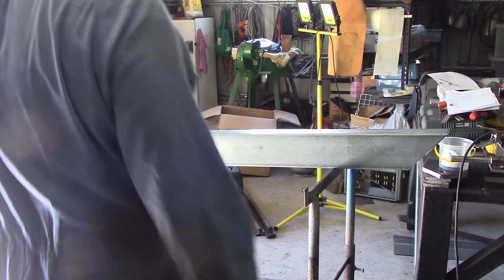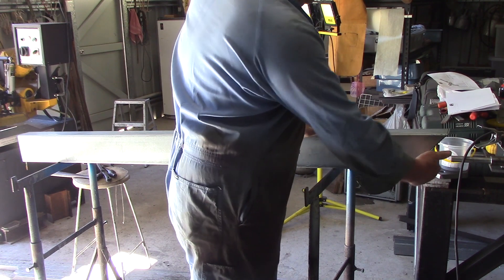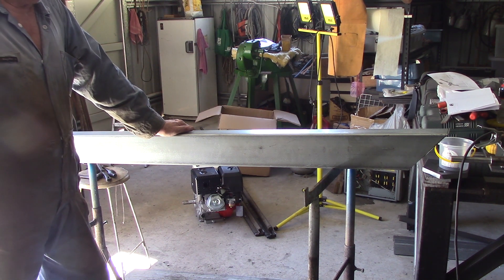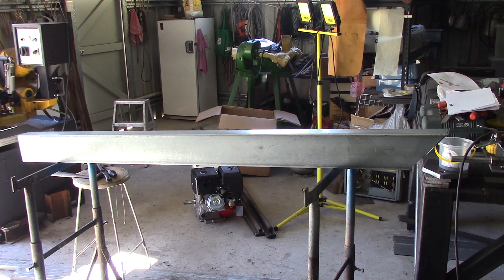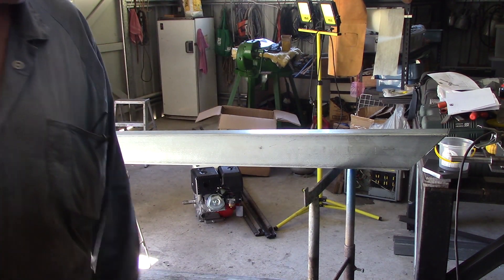So I've brought the main bar of the trailer in to start welding it up. I'd just like to point out this is the bottom. I've got a 45-degree angle in here, and that's mainly so I can mount the sort of drawbar hitch I want on it, because I'll be dragging this around behind a compact tractor or the Rigon mower. I imagine most people will be dragging it around behind something rather small — a small tractor or garden mower. So you probably want much the same sort of pitch, but if not just cut this however you need to make the hitch that works for you.